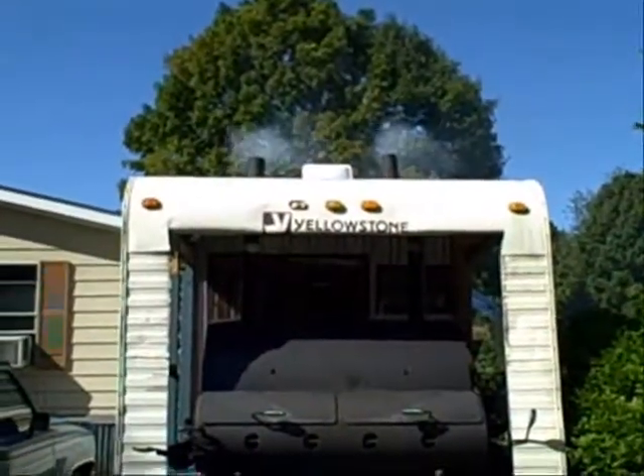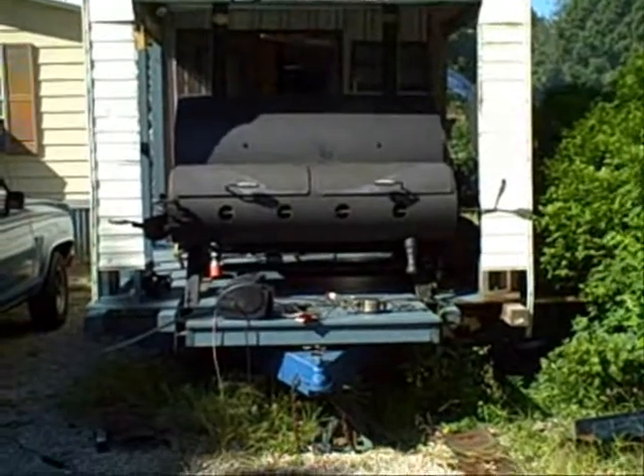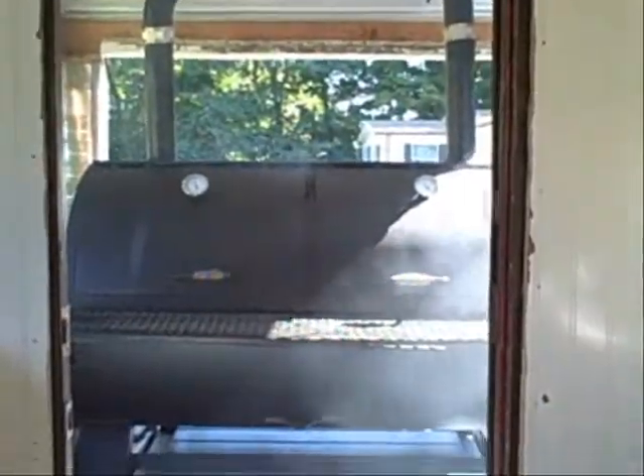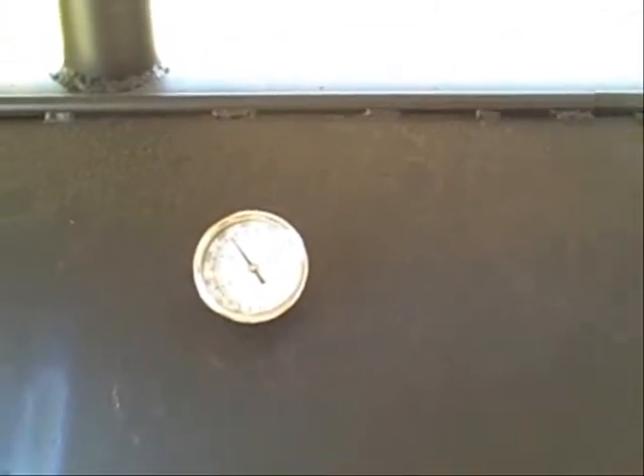Those are about the ugliest stacks, but they work. See that valve right there — it goes between the main chamber and the firebox. I've got it totally shut. This one over here, the black one, operates the opposite way, so it's actually totally open. I've got the right side totally open and the left side totally shut, and we have a temperature variance of looks like 260 degrees.